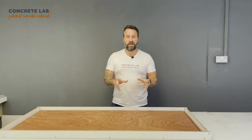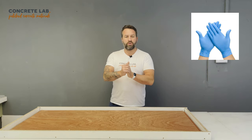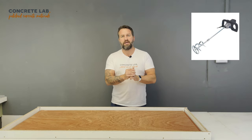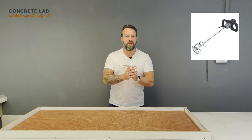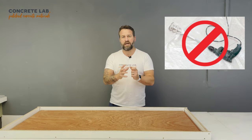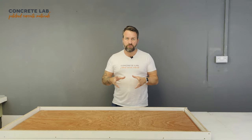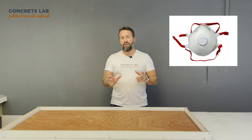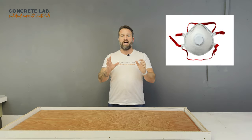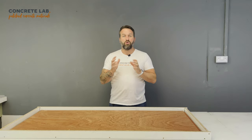For this stage of the project where we're going to be mixing up the concrete, you're going to need first of all gloves. You're going to need a paddle mixer — a single paddle mixer like a plasterer's mixer as a minimum. Don't be tempted to use a paint whisk attached to your drill because you'll just burn your drill out. You need a single paddle mixer with a bit of oomph. We have plenty of dust extraction here so there won't be any airborne dust to cause any problems.